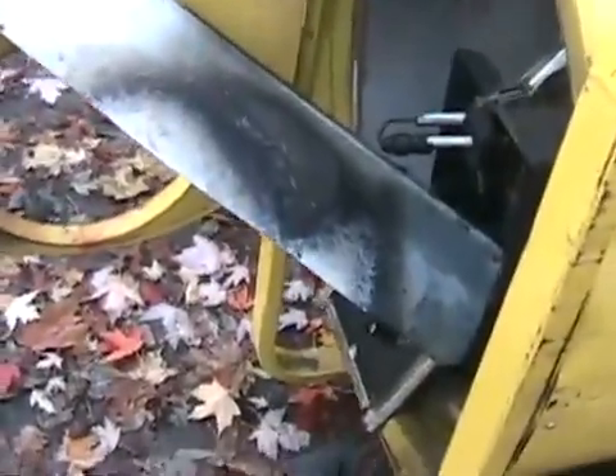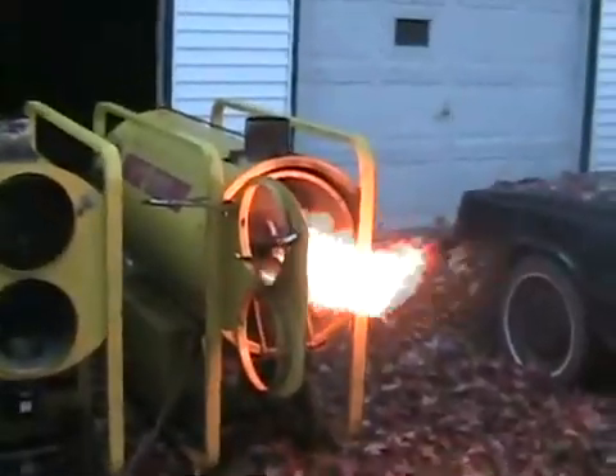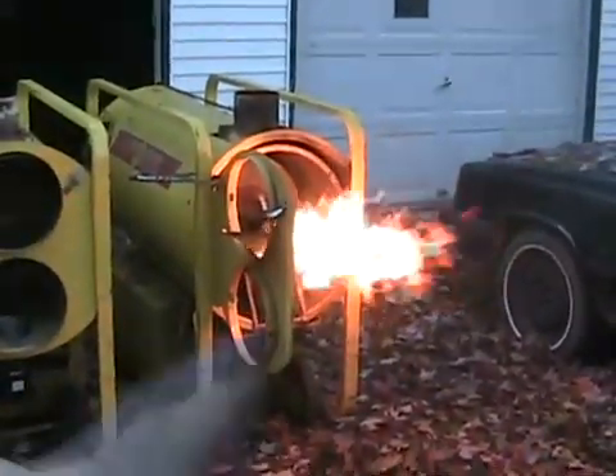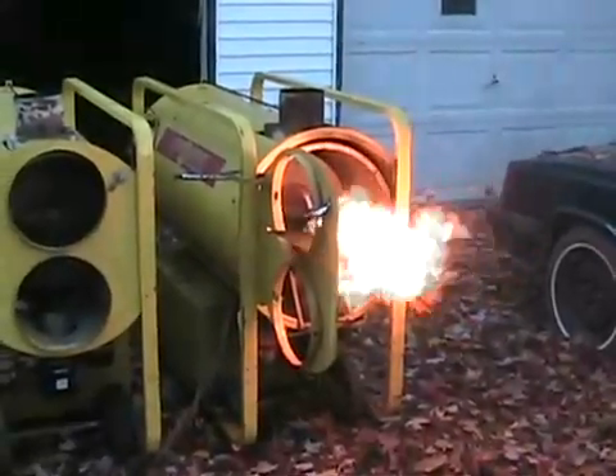Power on. Air blower fan that blows the heat is on. Nothing happening here — gotta give it the dark signal. There you go. Now you know what your oil burning furnace looks like inside. This flame actually spins around inside the heat exchanger in a swirl chamber to dissipate more heat, making it more efficient. Now if I block that sensor and make it dark, this will shut down — because the spark could have quit working and you don't want to fill your furnace or this chamber up with unburnt fuel. Then the next time you light it, you could have a huge fire.